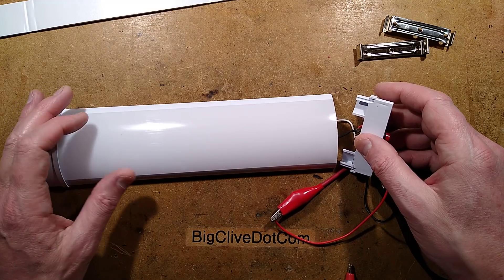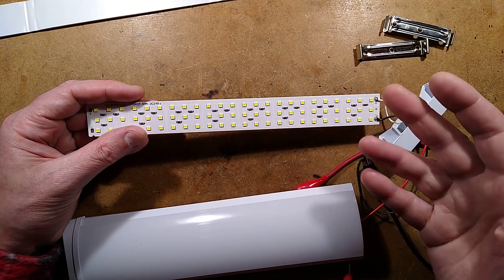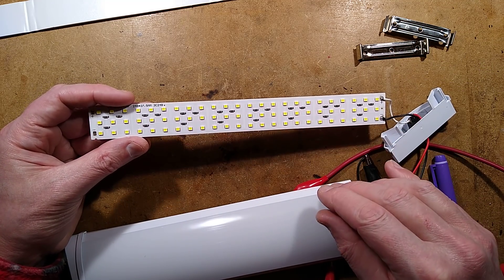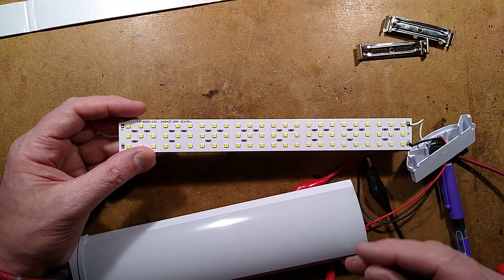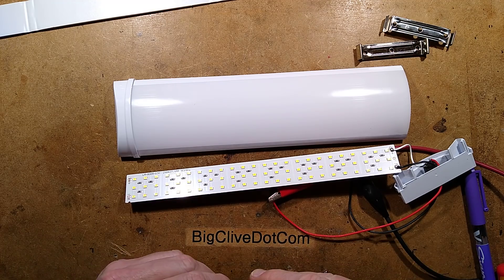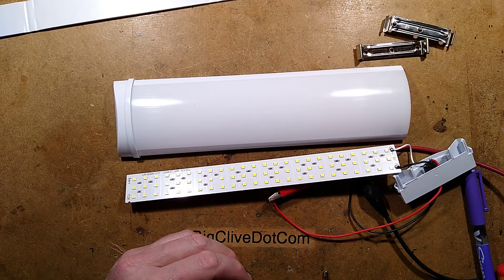I like that night light idea. It's useful — I could see in the future if there were power outages, having a 12-volt system with something like this would be quite handy. Certainly if you live in a camper, a trailer, or if you want extra lights in the back of your vehicle, this looks like it fits the bill. Just add those extra series diodes to nudge the voltage down from that peak charging voltage and make the LEDs last a lot longer. They should give a decent length of life. It's very neat, typical construction, what you'd expect. So that is it — the strangely named LED purification fixture. A very simple arrangement: multiples of three LEDs with a resistor per three LEDs, just like LED tape, and a little switch — everything on a small aluminum panel that slides into the strip light housing. Fairly standard and absolutely fine.